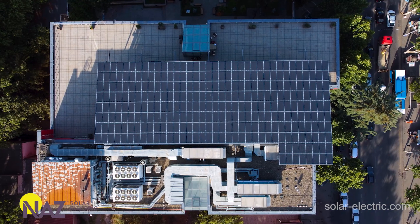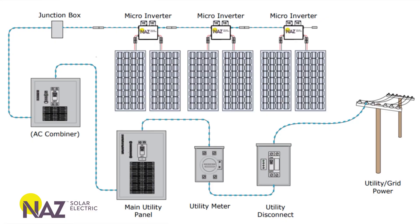Let's break down how AC coupling works. Most installations have solar panels on the roof and an interactive inverter — that's like a grid-tie inverter. These could be micro inverters, a string inverter, something like a Sunny Boy or Fronius, or Enphase micro inverters. These are interactive inverters. They cannot back up a home, they cannot offer energy storage at all — they must just produce power from the solar and dump it somewhere, usually either into the house or into the grid.